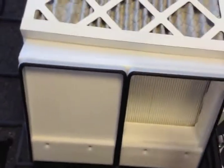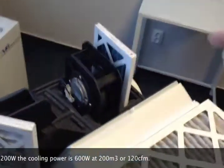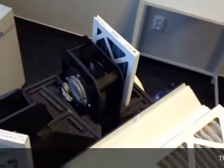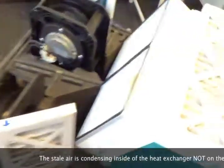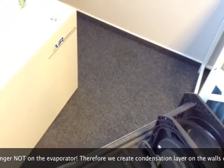Then we switch the flaps — it causes the same effect on the other side. So all of a sudden we have a tremendous booster, and we can do lots with very little power input. The power consumption of the cooling add-on device is about 200 watts. The cooling power of that add-on is about 600 watts, and it's enough to cool down the exhaust air from the house by an additional 10 degrees. That causes a tremendous amount of condensation on the incoming air from outside — it does not condense the indoor air; it's just above the dew point.